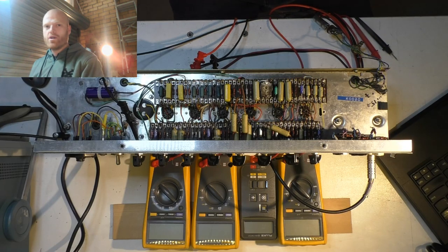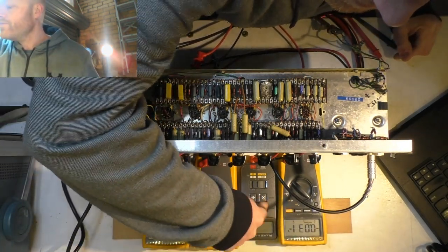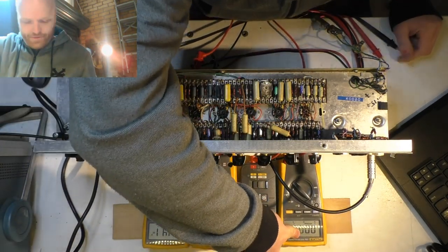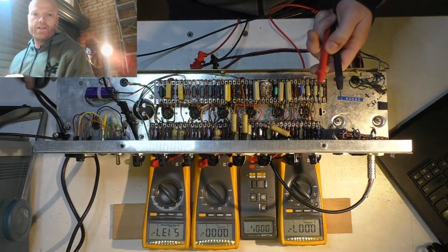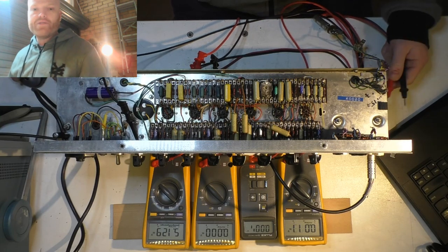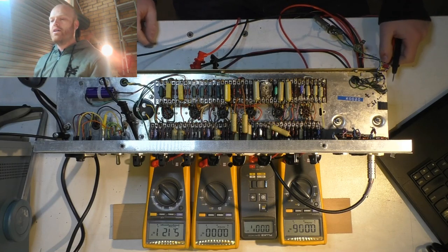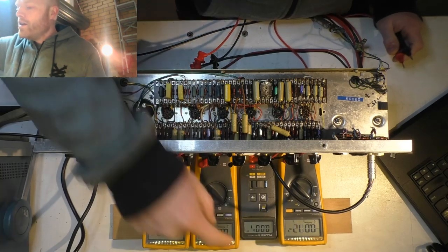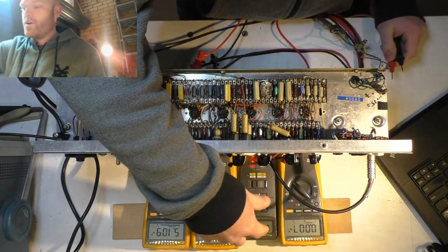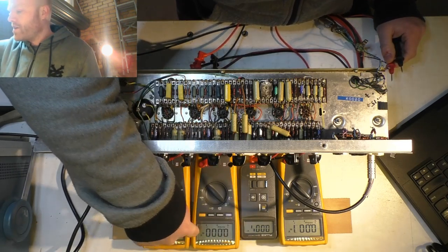So, let's fire it up and do a few measurements. I'll turn these things on again and explain what I'm measuring. Here I have these leads, just in case I want to check anything. What I might do is shove them in the front of the variac just to show what the mains voltage is. For the moment, because I've checked critical voltages and nothing's way out of range, I don't need the leads free. So I'll shove that in the variac, so that'll be the mains voltage coming into it, which I've got adjustable because variac. AC voltage, that's the heaters, just to check them.